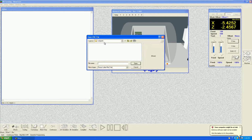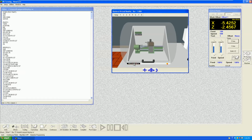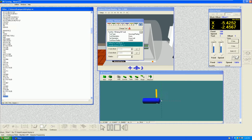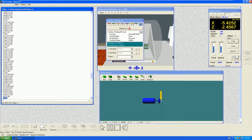We now load our toolpath, which Fusion 360 generated for us. There's the toolpath. One thing we need to do is just define our stock so that the simulation works correctly. That's done with a billet command. 15mm diameter by 50mm long, and save the file. Open up a virtual thing and run the code, and there it is, running the virtual simulation.